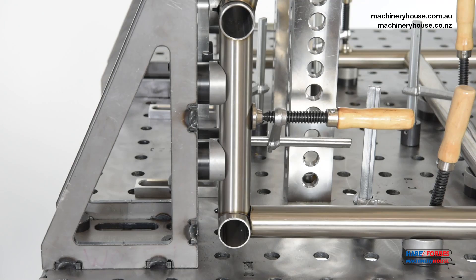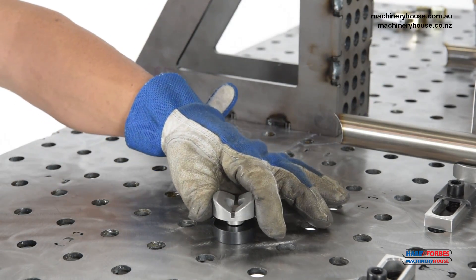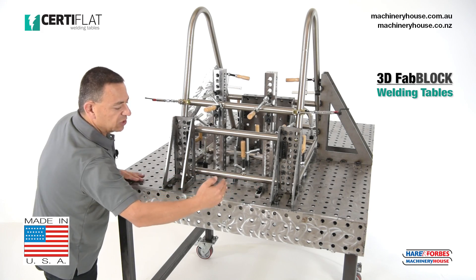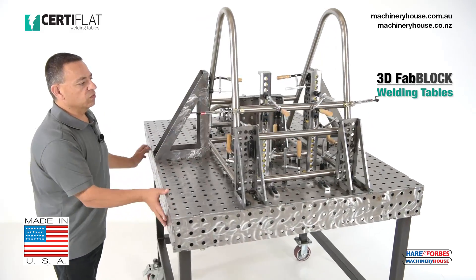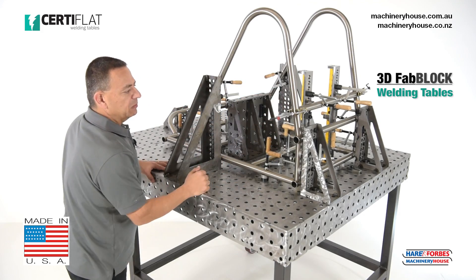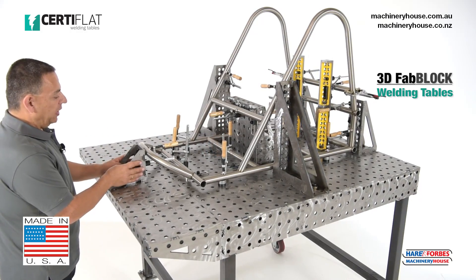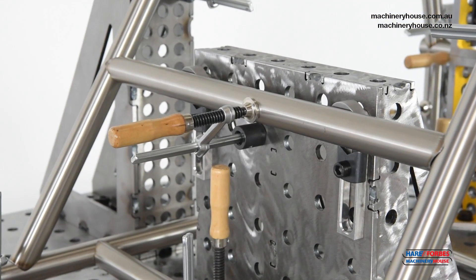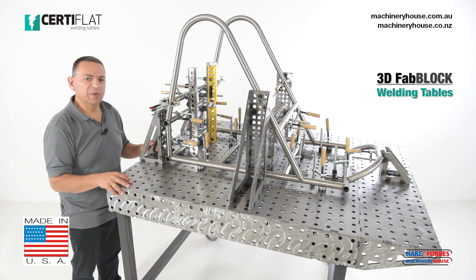We have a fab square which is 90 degrees. We have clamps all over. We use V-blocks and V-block spacers. Just rotating over here to show you a better view of our V-block adjusters. As you can see, these arms we can adjust in a horizontal position to reposition the tube to line up where we need it. We also use riser blocks to hold a tube in this particular instance horizontally at say 350mm off the table surface. Around here we have another fab square, and another addition to these are fab wings. We use a fab wing in the middle to hold the tube in a higher position, and we use a fab wing here to extend our table to make a bigger table surface area. Now I'll show you how we set up this buggy frame from the beginning.